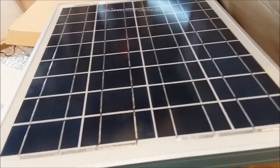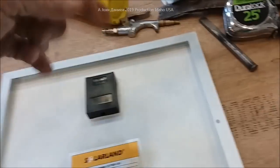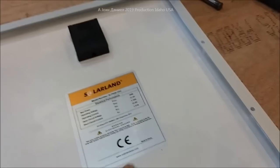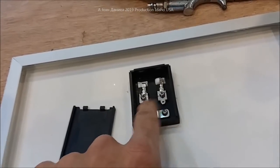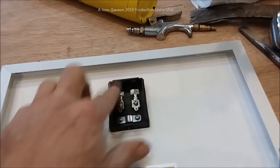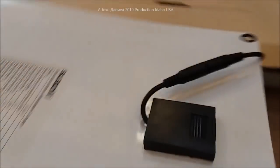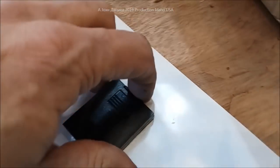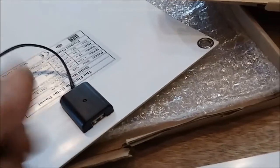If this specs out, I'll be ordering a bunch more. It's just a 20-watt panel. Now, I'll put a link in the description below the video. This one has no diode, no wire, nothing. What I want to do is solder on a diode — these other panels have the diodes built in. I find this one unusual because it does not have a USB port; this other one does have a USB port with a film resistor that produces about 5.3 volts, which is good for charging cell phones.